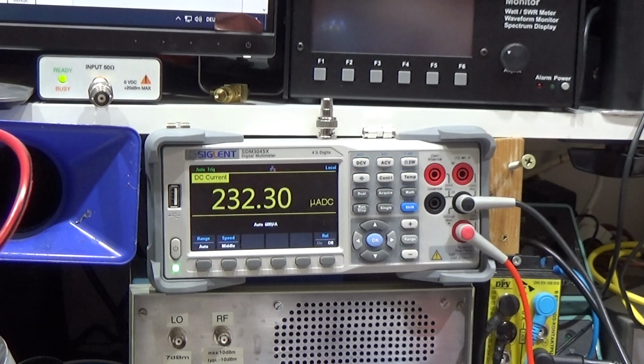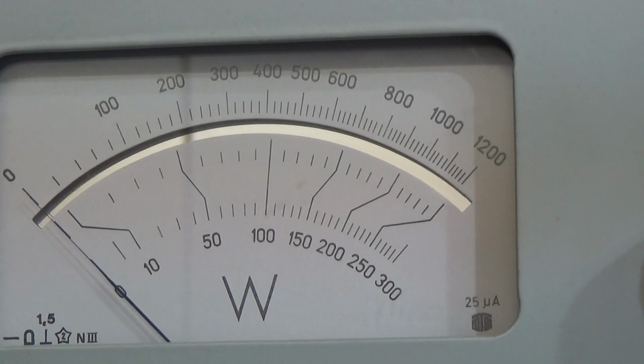And now let's see what it means when we key our radio now. Right, so the radio is set to FM so that I have a permanent carrier, so that is easier for demonstration. But we still have the same output power from the radio, only 50 watt approximately. And you have seen with our converter circuit, we have engaged the PA. Now the PA will amplify our 53 watt. And let's see what will happen if I press PTT now. So now PTT. And here we have it. With only 53 watt coming from the radio, now we have 1.1 kilowatt output, right? So very, very nice. That is great.